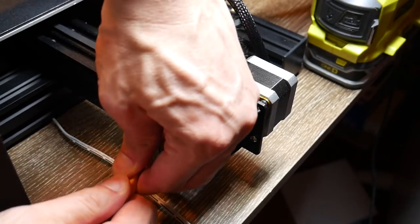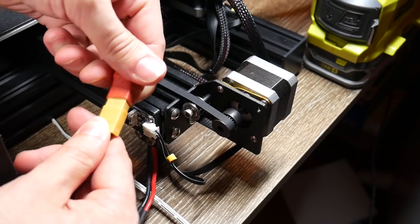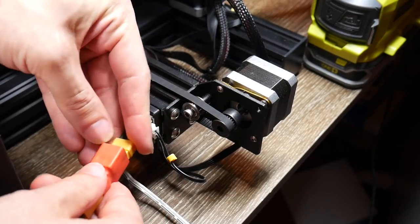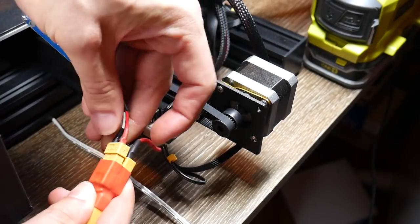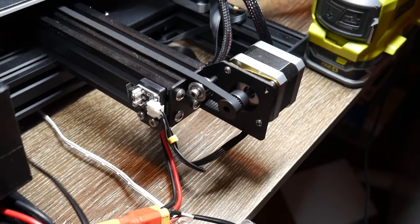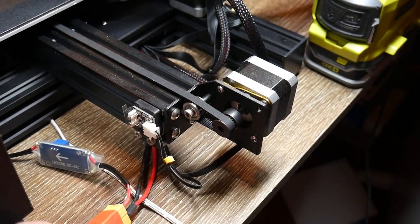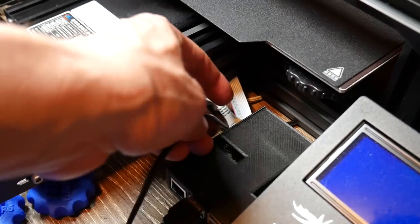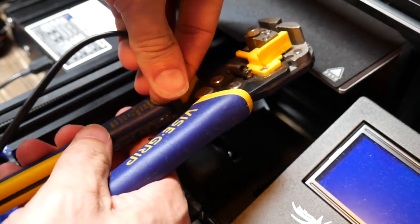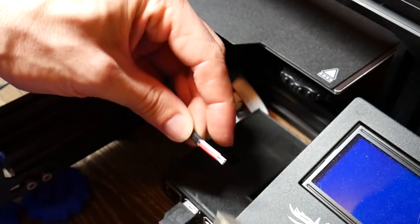Now come to the printer, unplug the original connection, and plug in the double adapter. Into one end of the double plug in the original printer wiring, and into the other comes the new buck converter plug. Route the wiring to the front of the printer. The aim is to get everything into position so we know what length to cut the wiring that will run to the Raspberry Pi — that way the install will be as neat as possible. Put it roughly in place, cut it, and strip the wires, ready to set the output voltage of the buck converter.